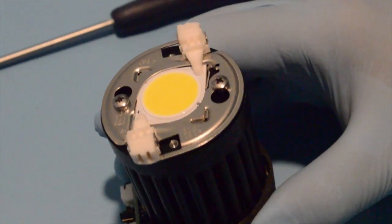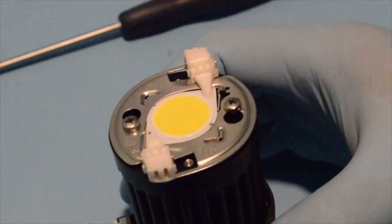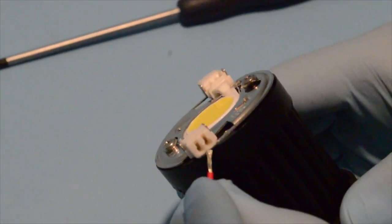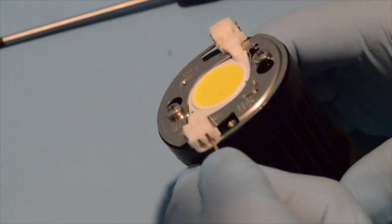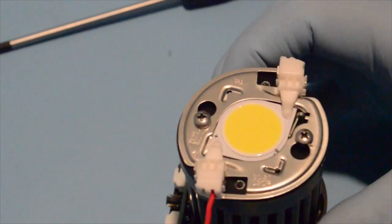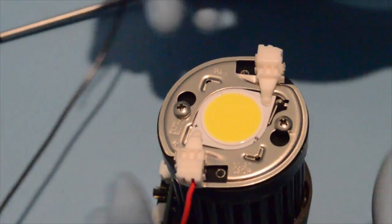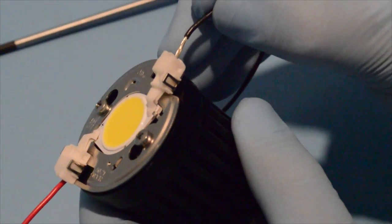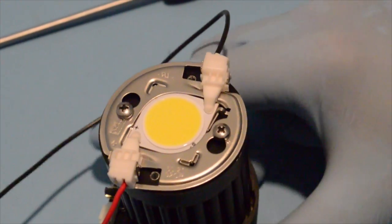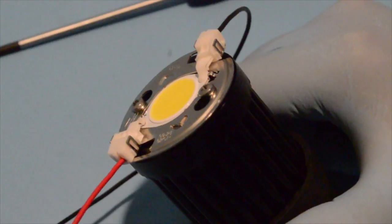Now that we've assembled the unit, we're ready to test it out. So I'll come over here and bring my red lead up to the positive connector. This is a push-in type connector. So I push just in the base of that hole, give it a push, and then the connector retains the wire. Likewise, the same activity with the black side. Push in, we've made contact, and now I'll apply power to the part.